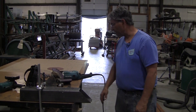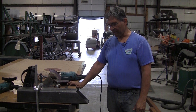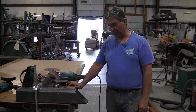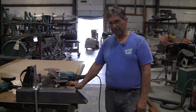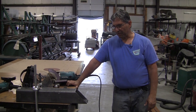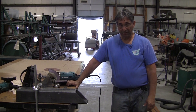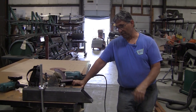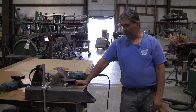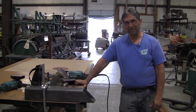And that's how you cut the 45 with a cutoff wheel and a 7-inch grinder. We also tried one of those metal cutting blades on a skill saw — that cut the stuff pretty good, but the shoe wouldn't stay quite square and we had trouble keeping a square cut going through. But you can cut it off with that too, it cuts pretty quickly, and you can go back to the grinder and clean things up and square them up however you like them. Just remember that there's always more than one way to skin a cat, and this is just how we happen to do it today at Pro Shaper.